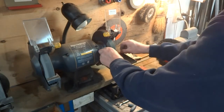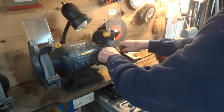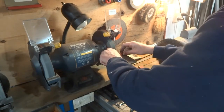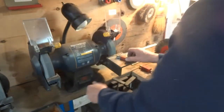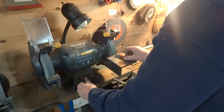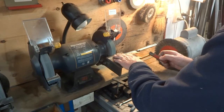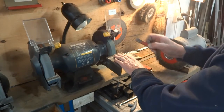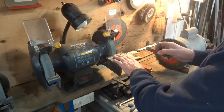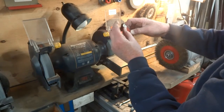So I'm going to take this off now — it's just on screws. Put that over here where it belongs, and we can sharpen our tool bit. I should mention that I have this set at somewhere between two and three degrees relative to the base of the grinder itself, and that will give me a little relief angle underneath here where I'm sharpening.